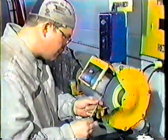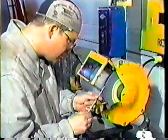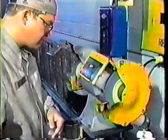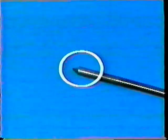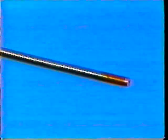Ensure, while you are grinding your tungsten electrode, that you keep it quenched. Now grind one end of the tungsten electrode to a tapered and sharp point. Here is what a properly ground electrode should look like. Caution: make sure you do not grind the colored end of the electrode — it is marked for identification purposes only.